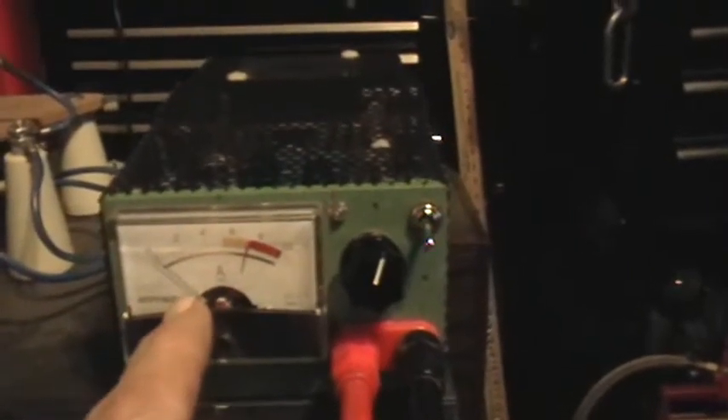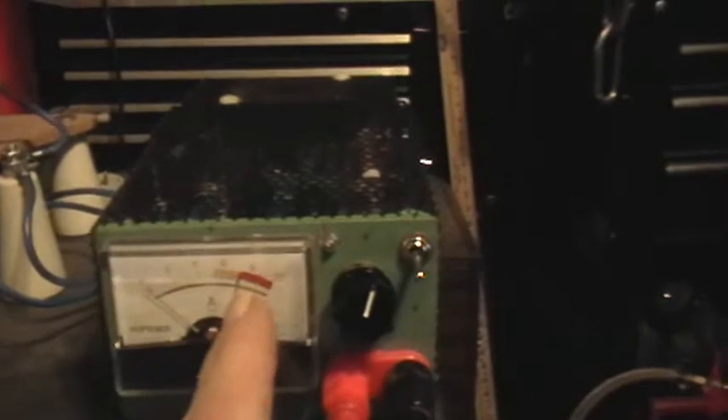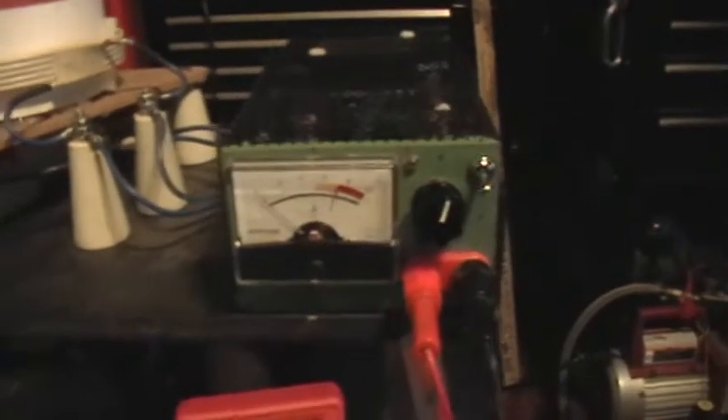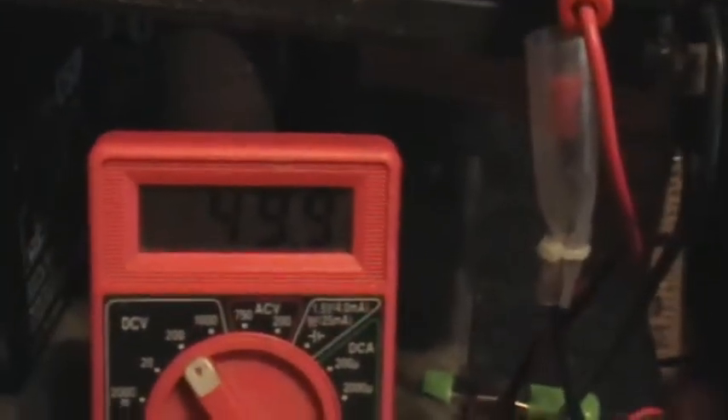I took the basic circuit and added an inline ammeter so I can monitor the input current. I've found that if I go over about 5.5 amps I'm starting to put the MOSFET in danger, and at around 7 amps the thing is just too outrageous. I've generally fused it at 7 amps, but right now I've blown all my 7.5 amp fuses so I have a 5 amp fuse in there. The power supply is set to produce 50 volts with current limiting set to 5 amps so I don't blow fuses or MOSFETs.